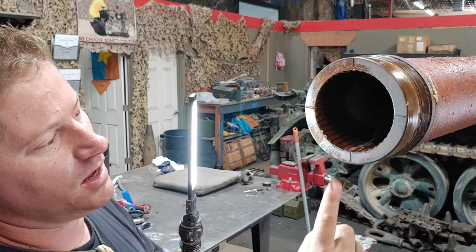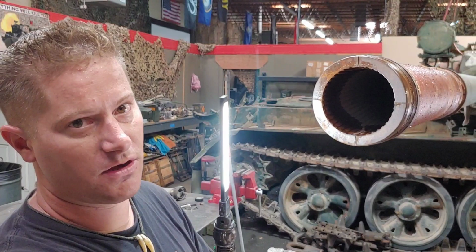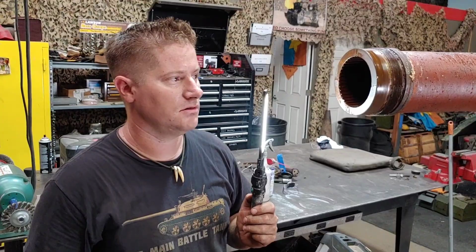And what you do is you run a piece of wire through these notches and you create a crosshair. And then the guy inside will be able to look down the sight and see the exact cross through this, and then he can talk to the gunner and actually zero their periscope and telescope off this point. So this is a very old way of doing it, but this is the only way we need to do it. We don't need the fancy sights or any of that.